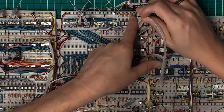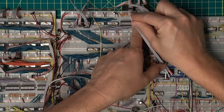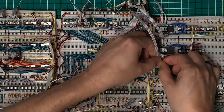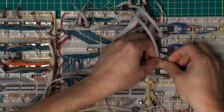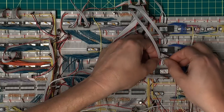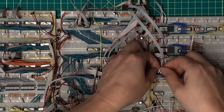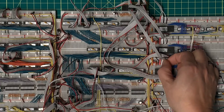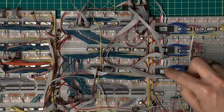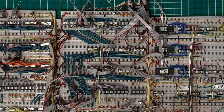Let's get this installed. The source for all of this is here, with the red indicator towards the least significant bit. It's just a matter of plugging each one in appropriately for control ROM 1. That's bit 8, the next one over is bit 9, then bit 10 — which is up here in between chip enable and output enable — and then bit 11 is the last remaining one. And it's that simple.